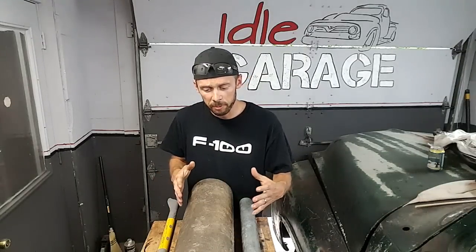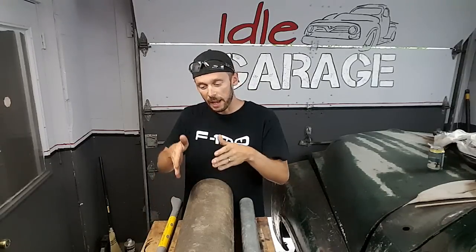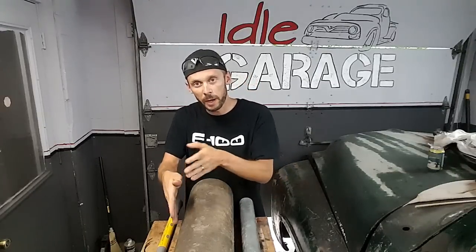Now what his plan consists of is a large diameter middle pipe, and then two smaller pipes on each side. He made his much longer than what we're going to make here today, because we're confined by space — his was like 53 inches long. Ours we're going to cut down in two-foot sections. The basic idea is one larger pipe with a smaller pipe on each side, bolted with a little bit of a gap. What that does is it allows you to put sheet metal down in and bend it over the pipe, giving you a nice tight radius or a much larger one. And with it being a heavy pipe in the middle, you can use it to beat and shape different things on it as well.